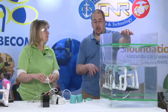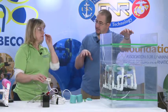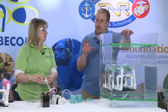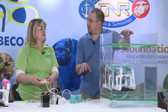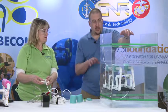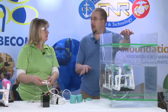In a larger pool, that's probably perfect, because as you go down, water's going to have a tendency to compress the foam a little bit, so it'll actually get a little bit heavier as you go deeper. So that's all it takes to balance your Sea Perch and get yourself ready to go.